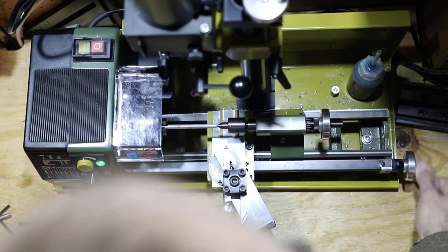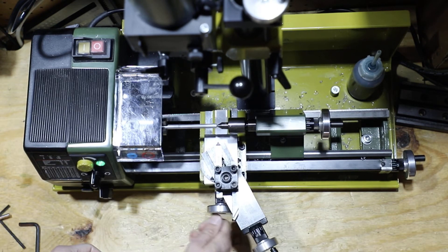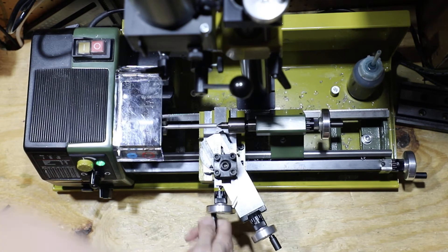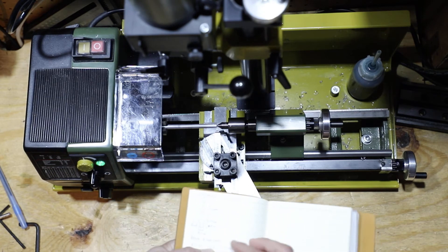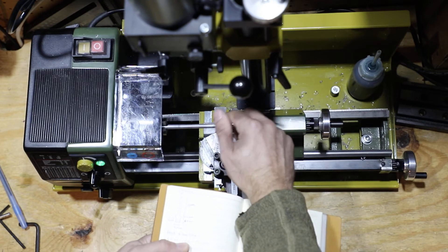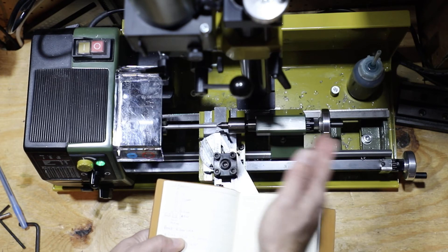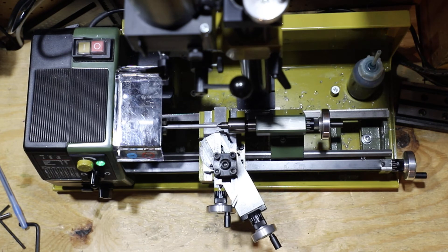If you're making parts where you already have a detailed spec, it's very important to follow a procedure. Play around until you get your part designed perfectly, then remember how you did it — write down all your measurements so that you can rinse and repeat. For this individual post, the threaded area is going to be a total diameter of 4.8 millimeters with a 10-24 thread. The stock itself is quarter inch, which is roughly 6.3 millimeter rod, and the entire piece is going to be just over 40 millimeters long — about 4 centimeters.